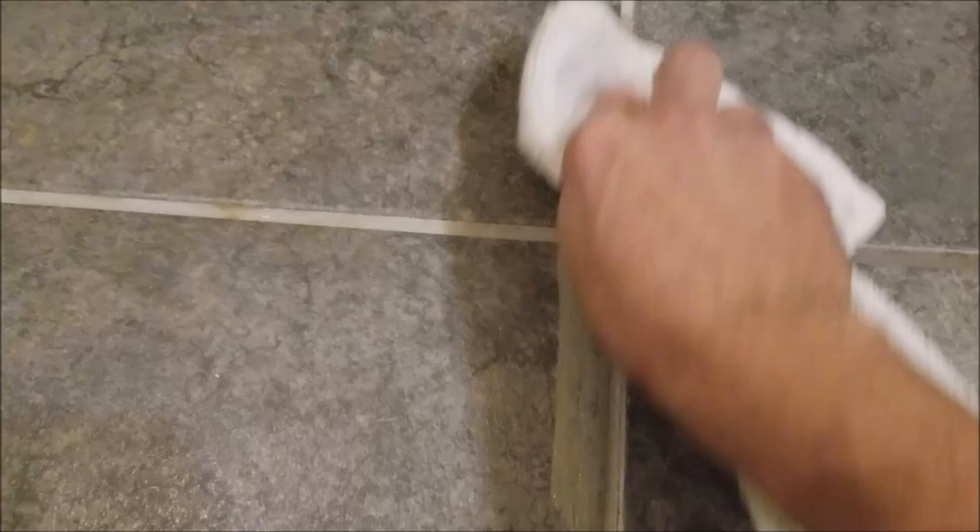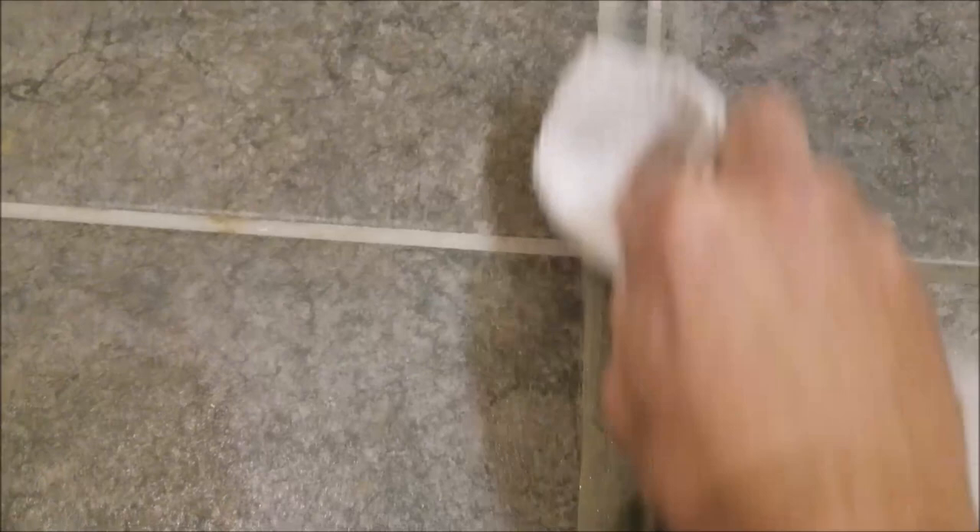I'm going to test a small area of the grout using just a rag to see if this color matches. I'm going to start with the lighter color first, because you can always go darker, but if you apply the darker color first it's hard to get lighter. For my initial tests I'm just going to stick to a small area.